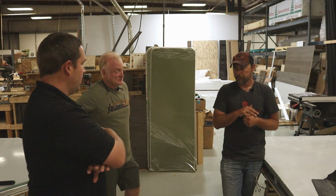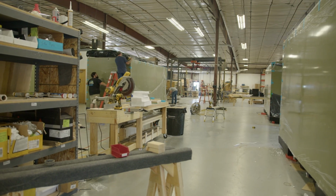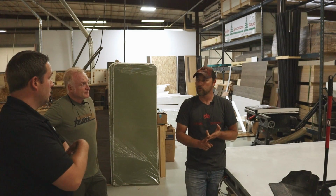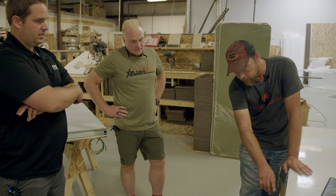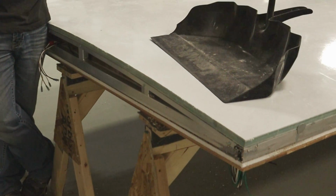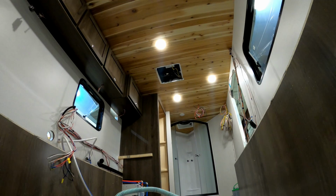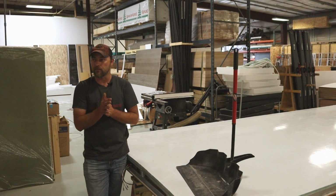If you want this type of quality, the practices and methods of how you're doing it, you don't see this on anything, not in travel trailers at all. The drawback is it takes longer to produce, costs more to produce, and is more challenging to produce. There is a layer of vapor barrier between the foam and the aluminum as well. Because we do have wood paneling and decorative wood, we want to keep any moisture away from that and keep it a dry environment inside the trailer.